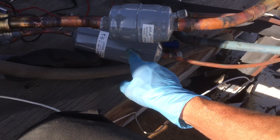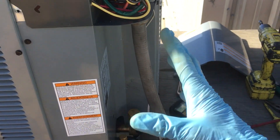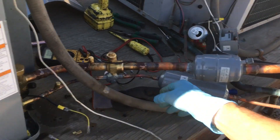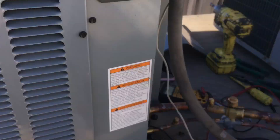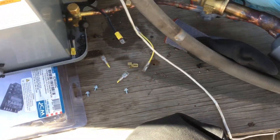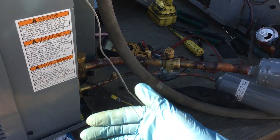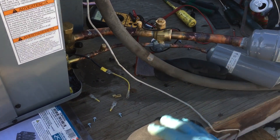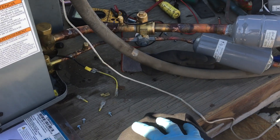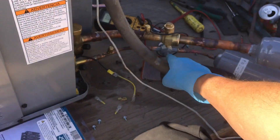But with this huge filter on here — consider its cubic inch volume and how many equivalent feet of 3/8 line set that represents — my son came out here and did superheat and subcooling measurements. He found he had to add about nine more ounces of refrigerant to compensate and bring the subcooling up to what the manufacturer specified. When he did that, the sight glass cleared right up. I didn't have time to do the refrigerant charge myself, so I sent my son out to handle it.